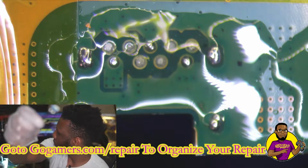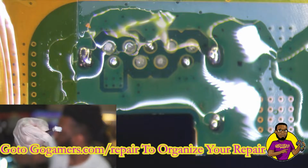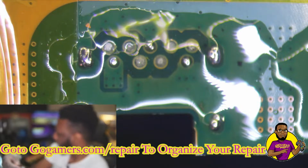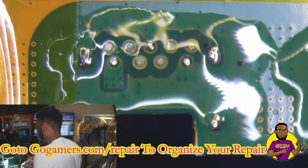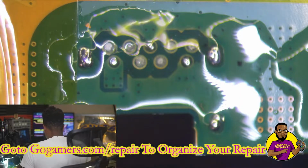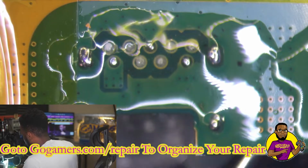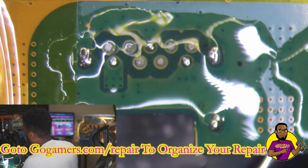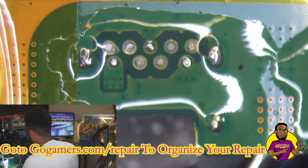It's not really focusing, but you can see back here, I'm holding it with my smaller tweezer, right? And I'm holding it right at the edge, because you can't go too far in when you're holding these. Now you can also go from the bottom as well, but the thing is, it makes it a little bit more harder when dropping it into place. So it's just good just to go from up top. Just go slightly in. So you're going to go just a little bit in, and now we're going to heat it up. And we're going to wait until this solder starts to flow. Once the solder flows, we're going to drop the new USB port on the motherboard.